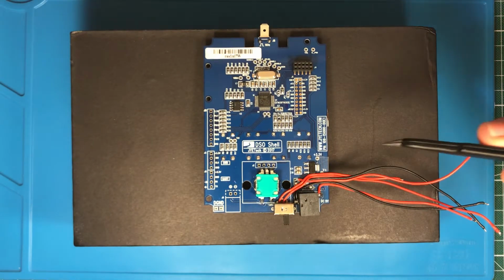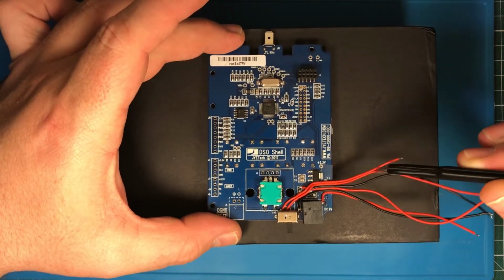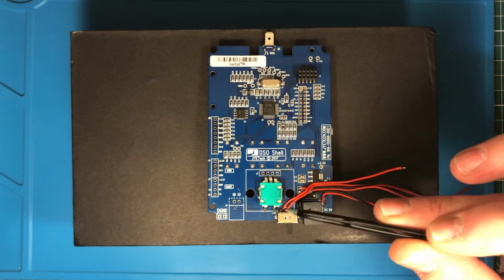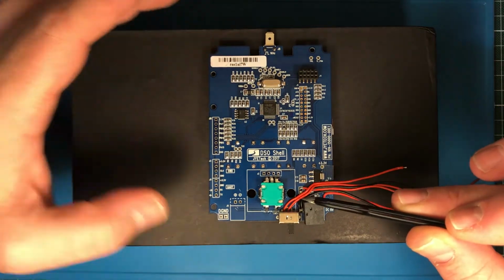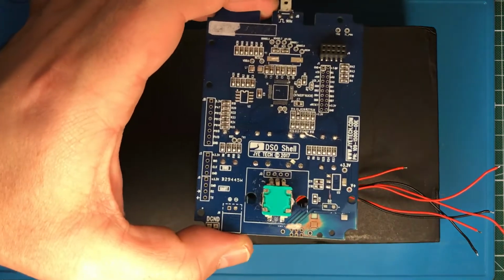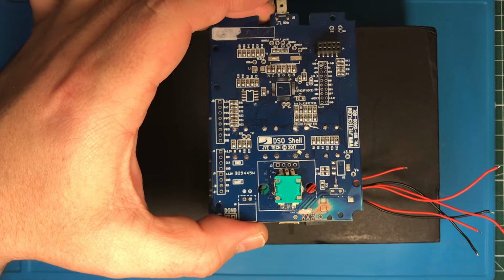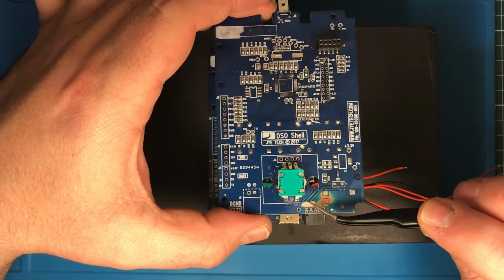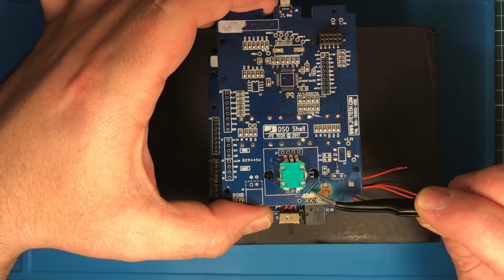The first two wires, the red wires here and here, are going to the switch, underneath the switch. To do this, I have to cut the two traces going up to the rest of the circuit here. To show you what I did, I sacrificed a board for you. Not really sacrificed, it just burned during the process. So, goodbye, one has left us. But so I'm able to show you which traces I cut.